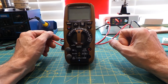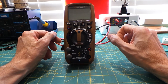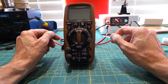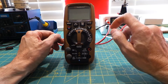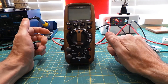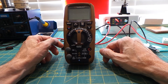The only thing I wish it came with is a wider assortment of leads and probes — I ended up having to buy a separate set with a plethora of assorted leads. Keep in mind that if you go this route, you might run into a problem where the leads don't work. This is most likely caused by the plastic ends on the probes being a bit too long and preventing them from seating properly. An easy fix is to just take a utility knife and cut back a short piece of the plastic, and they should work just fine.